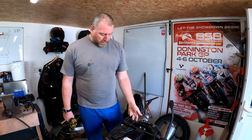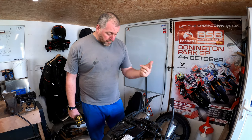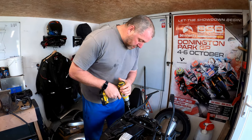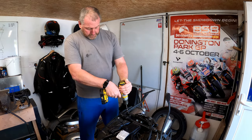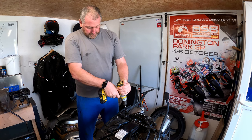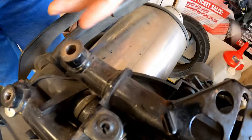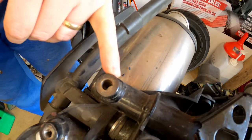Now, this isn't a blind hole - this goes all the way through, so it does make our life a little bit easier. Obviously with a blind hole we can only go so deep and then we have to stop and clear all the swarf out, but we won't have that problem here. So I've got my drill bit fitted into my drill and all we're going to do is gently drill it out. And there we go - that is all the old damaged threads drilled out. As you can see, there's no thread in there whatsoever - we've got a nice clean hole ready to be retapped.